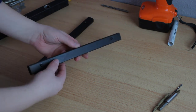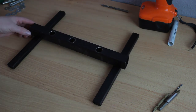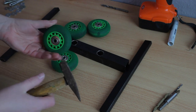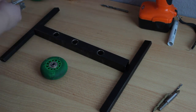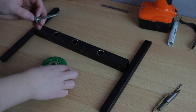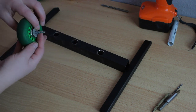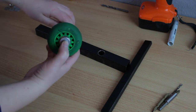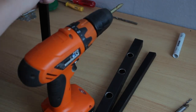Now get the other two flat rods that should be 8 inches — mine are 9.8 inches long. Place them the way you want the result to look. It will look like that. Next, press the bearings into the inline skate wheels. Now get the screws that go through the wheels: get the screw, add two washers — one on the outside and one on the inside. Then screw this into the wood inside the flat rod so it's stable. Use the Phillips head screwdriver or the flat head screwdriver, depending on what screw you have.